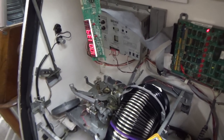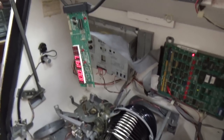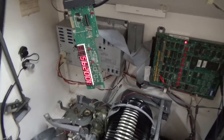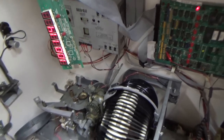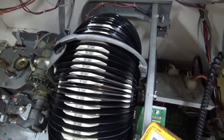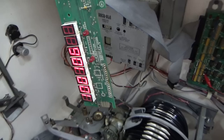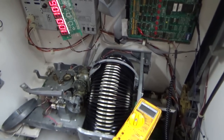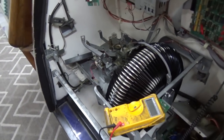The problem right now is whenever you let it operate, it just spins and spins and spins. It's spinning around and never comes to the home position, and we're trying to figure out why. Now that I look at it, it does seem like it's not lined up right — it says we're at 106 but we're at 137. That ain't right — it's not even close. So let's turn it off and back on and see if it catches it different.